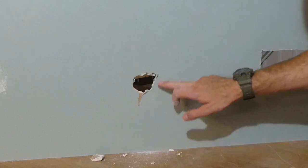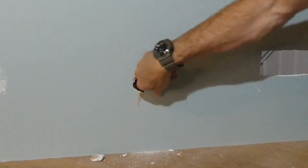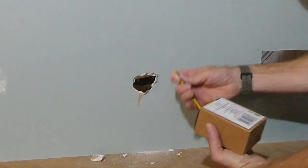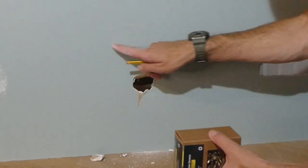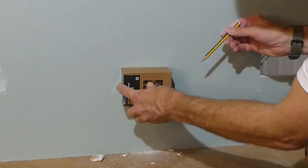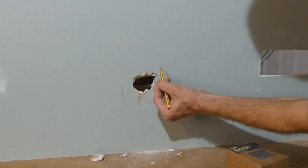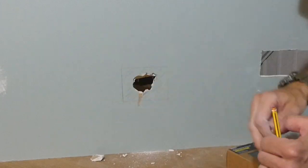The next thing we need to do is to cut out around this. There is a bit of a breakout — probably about half an inch all the way around this hole. I want to try and cut this out as square as possible, so I'm going to find something like a box, a screw box, which isn't too much bigger than the hole. Try and find something that's a similar size, keeping it as square as possible, and just mark around that object. I've got quite a nice amount to come out around that, so I'm pretty confident that'll be a nice square edge with no breakout.